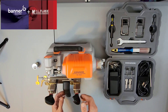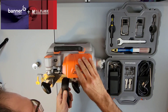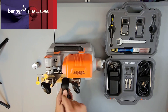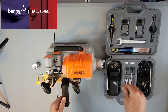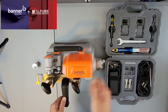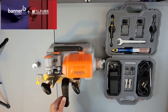One of the things I'm going to show you is that you're going to have to calibrate the machine from time to time. I'm going to show you how to do that now. I'll start off by checking the stylus, and the stylus is going to have the exact same angle as the blade. You'll need your Allen key, and that's part of the toolkit that comes with the Condor. You've got a brush to brush away any brass shavings, wrenches to change cutting blades, files, charging cords, and power cords — everything you need to operate this machine.